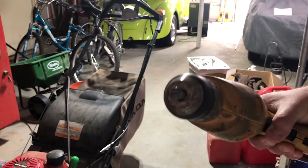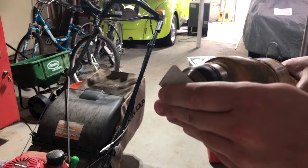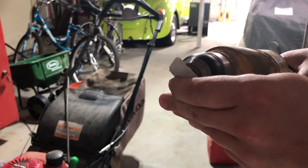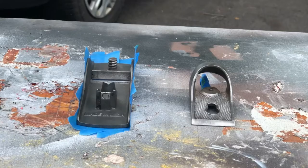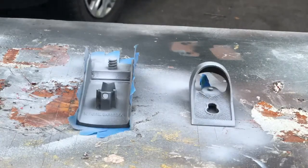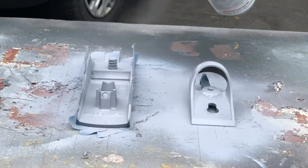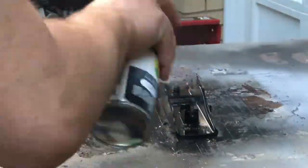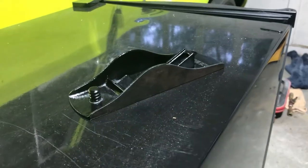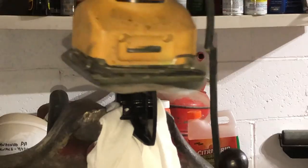For the pieces that don't need paint, I'm going to use really fine sandpaper to sand away all the imperfections and then shine them with a metal polish. I'll spin a screw really fast in a drill against some sandpaper and then against some metal polish — I'm going to do this with all of the metal pieces. Now to start the painting process, the first thing I'm going to do is apply a coat of Rust-Oleum primer. It's a really good brand for this because it's designed specifically to paint over things that were once rusted, to keep them from rusting further. The primer has been scratched up with a scoring pad to give the paint a better surface to stick to, so now it's time to apply the black paint. The last thing before reassembly is to sand and polish the three sides of this piece that don't have paint on them.